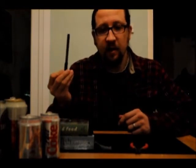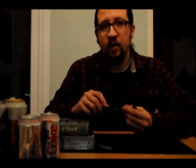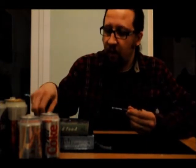Along with that, you need something to cut the cans with. You need something to mark around the sides, you need something to crimp one side of the can, and then for the jets where the fuel will come out of, you need something to make holes. We've got a little nail and a hammer so we can make them, but you can drill holes in, you can push drawing pins through. It's very thin steel, so it's quite easy to get going.